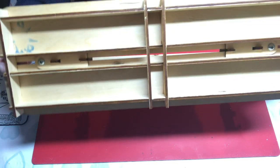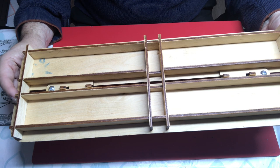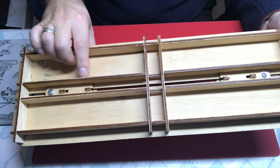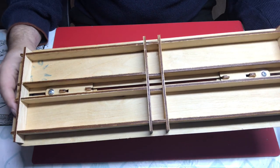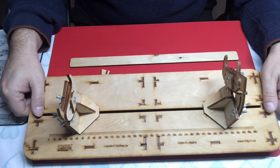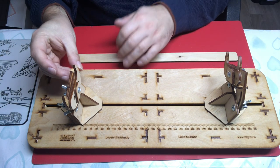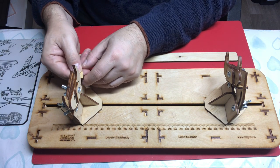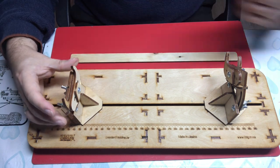There were bits still sticking out even after careful work. I had to file the edges on every single piece all the way around, and on all of the parts it was really quite difficult because the laser cutting hadn't been done well — in some places the wood broke away while trying to get it out of the frame. The holes also didn't fit properly and needed opening up. It was a major piece of work to get it to go together, taking far longer than it should have.